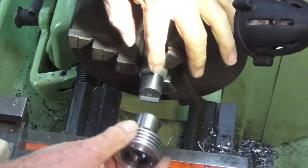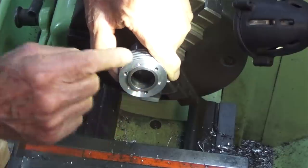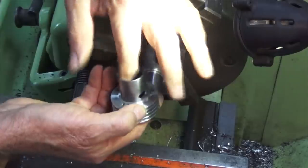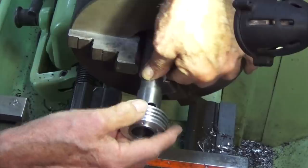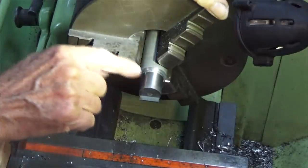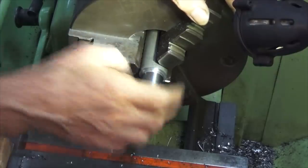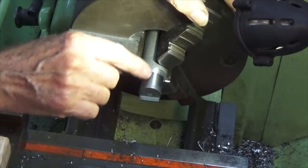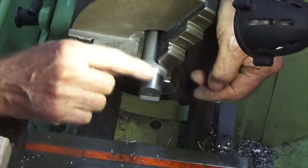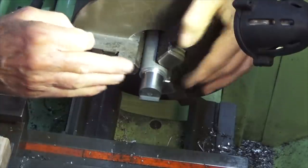What that means is that as the piston comes up to top dead center, its fit becomes tighter and tighter until it's almost a perfect seal at the top. But at the bottom of the stroke, it's a bit more free to run down the inside of the liner there. So I think our liner is right, and what we need to do now is just get the piston smooth and get rid of this weird pattern that's in it. I had a look at that after I did the first bit of sanding, and it's like a weird corrugated finish, but you can't feel it. It feels perfectly smooth, but I'm not too worried about that. It's really just cosmetic. It's the fit and the gas sealing that's more important.